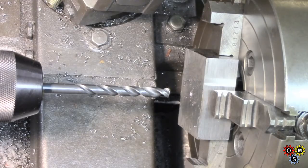Yeah, having measured it as close as I can, the inner diameter, small diameter on the thread, comes out about 640, which happens to be 41/64. And by sheer chance, although I haven't got a lot of big drills, I've got a real old 41/64, which I'm hoping might do the trick. Have to see. Let's try and get a quarter through first anyway.